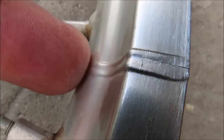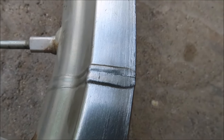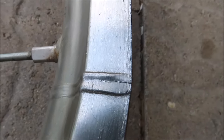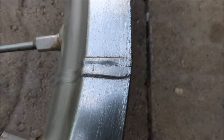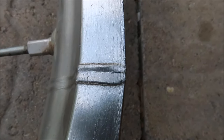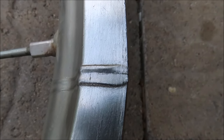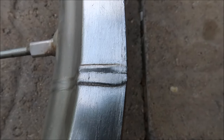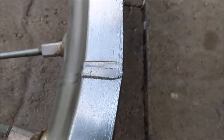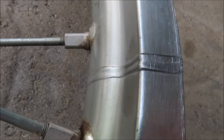It's raised up just a little bit. I'm not an expert at welding. I'm not sure exactly what material this is — it's supposed to be an aluminum rim, as far as I know, but it must be mixed with some other alloys. We got it up to about 560 degrees and it would not melt the aluminum welding rod, whereas on the test runs it was melting at around 450. So as you can see, it didn't melt, it didn't work at all, and it started pulling the rim together right here.